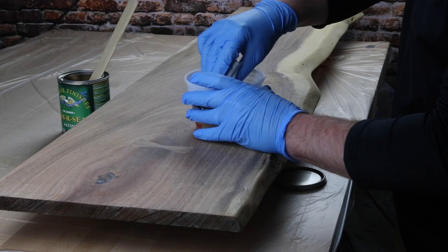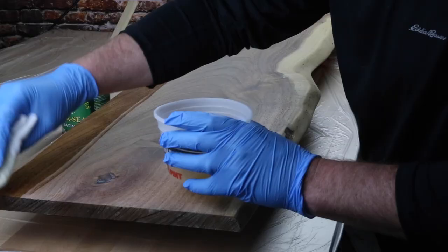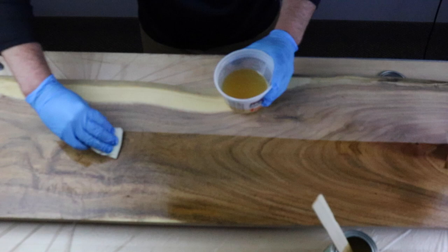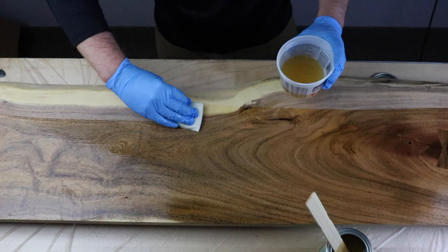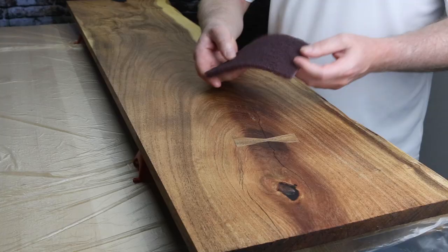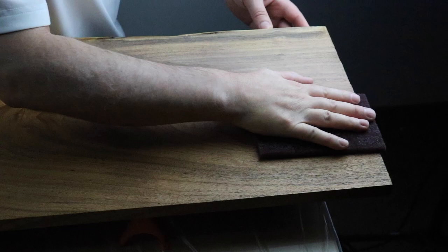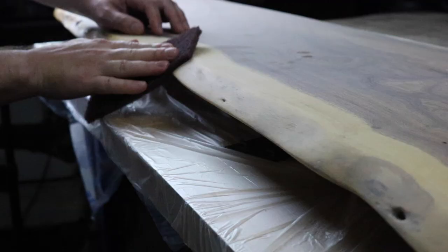Here's the beauty of Armor Seal: it applies really easily just by wiping it on, you wipe it off, you let it dry, and then you come back and do it all over again. The trick to getting a really smooth finish is to lay it down in overlapping stripes and don't go back and forth — just lay it down and move on. Then take a nice clean dry rag and gently drag it across the top to smooth out the ridges and overlapped marks, and that's going to give you a great coating. After this dries overnight, it's time to do some scuffing to smooth it out even more. The tool for scuffing can be really fine grit sandpaper, steel wool, or — what I've chosen — a synthetic finishing pad. It's kind of like steel wool except synthetic. It does a really nice job, but I'll post a link in the description. And once again, just for good measure, clean off the dust with a tack cloth.